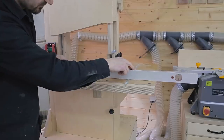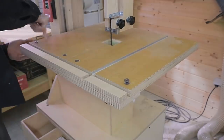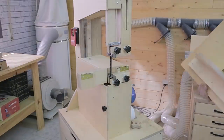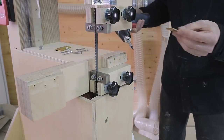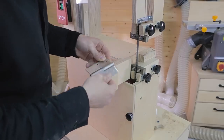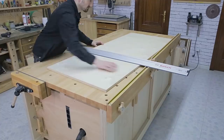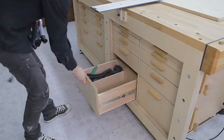Here you can see how the table is warped. I disassemble it and remove the hinges. While I'm at it, I'll fasten a more sturdy set of hinges, the kind used in interior passage doors. I'll cut the new table with my multi-purpose workbench, using hard birch plywood.